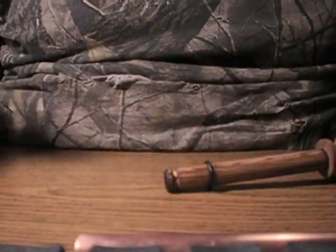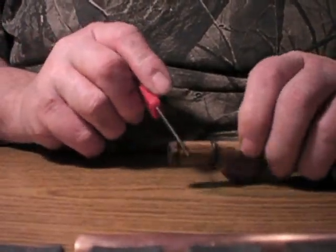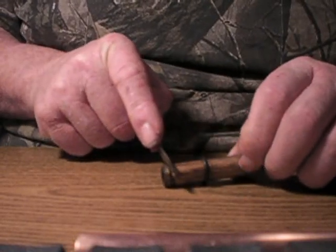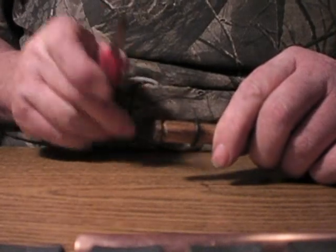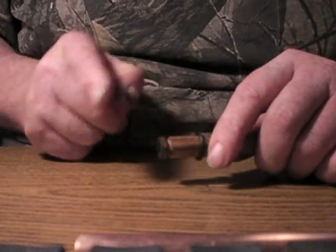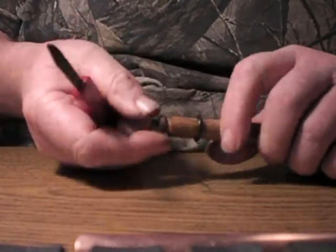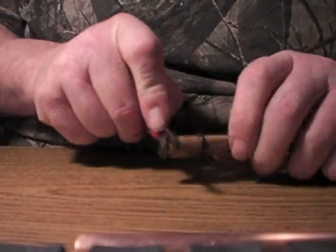The first thing I did was take the rod, which was about three feet long, and I cut this notch out right here with a pocket knife. I started by making a ring around the edge about a quarter inch down from the end, made it about a quarter inch wide, and just started going around cutting that out. I got it nice and smooth and took a little file and filed it out.